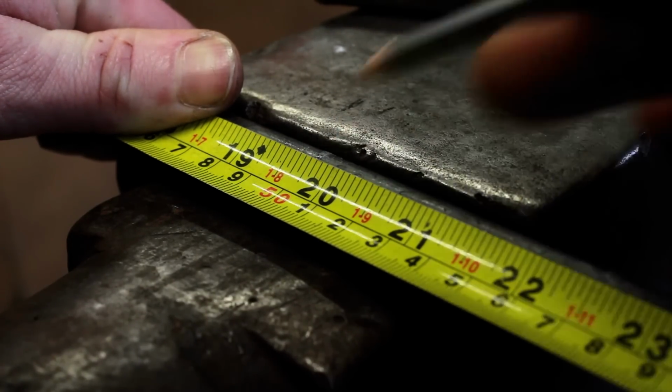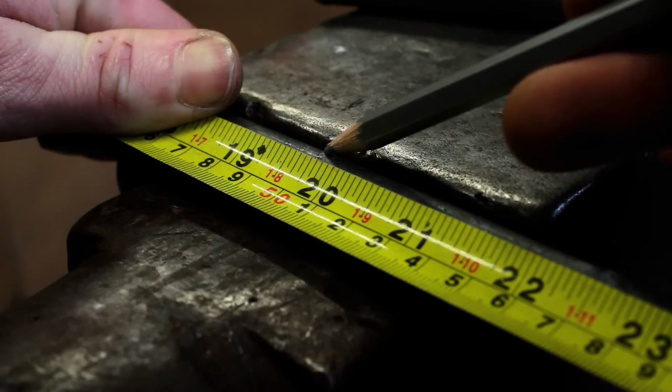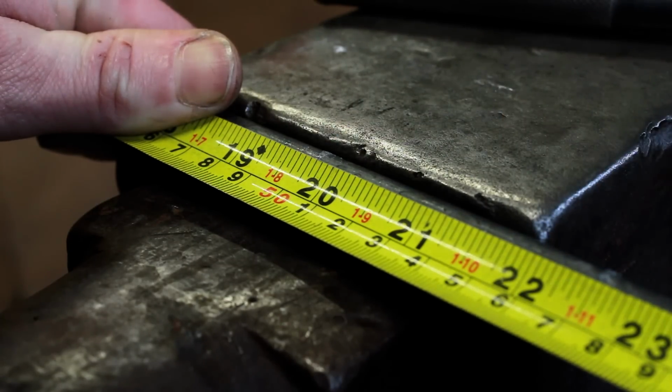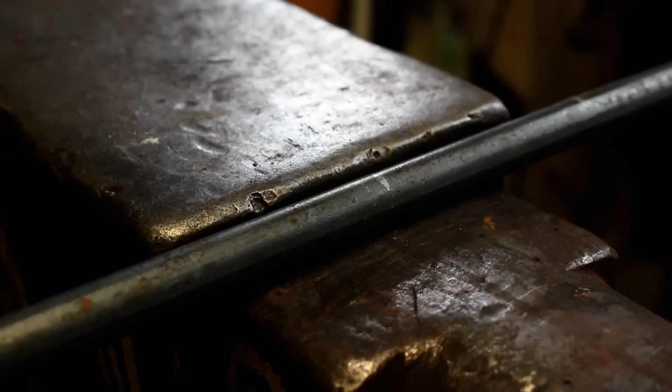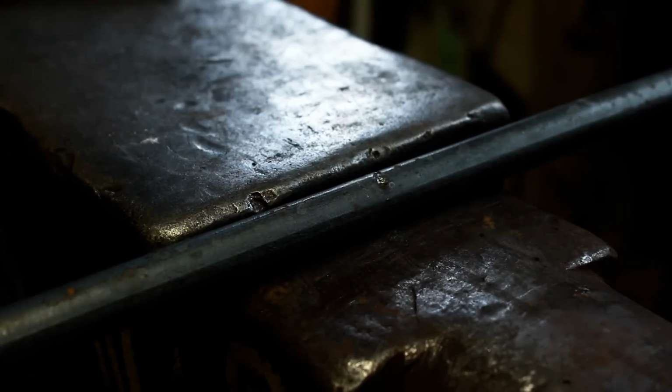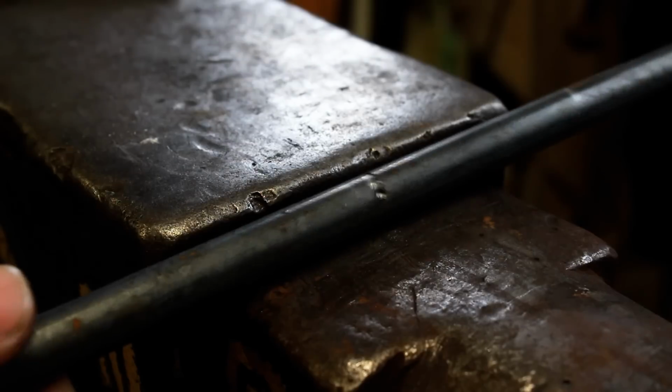And then you want to centre pop the 19 3/4, the off centre one. So we take the off centre one and we centre dot it. So you leave a mark. So this is our first initial bend. So you're going to want to find your centre mark.